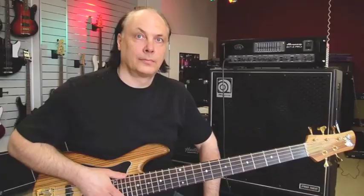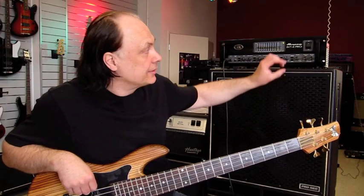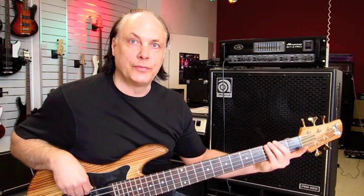Let's look at the crossover. It's good to start from the bottom end — it's something like 50 Hz, but of course it's not very useful in live situations because we have such low frequencies. Let's put it a little bit higher. In a live situation we can leave it somewhere like 250–300 Hz, and this is very good for a 5-string bass so you keep the low end safe. Now the low end comes from the 15-inch speaker.